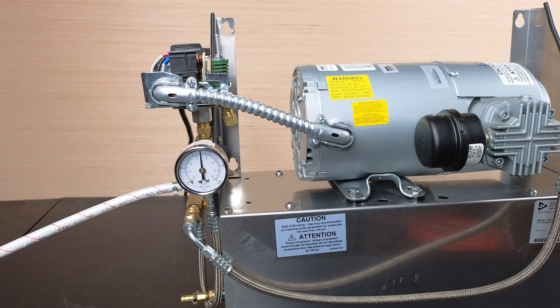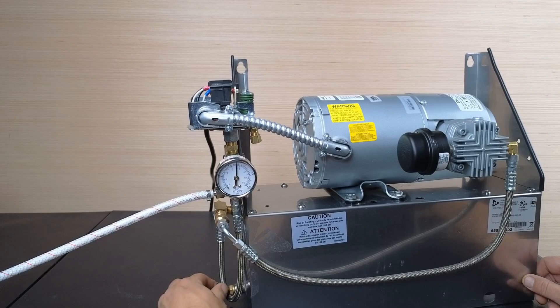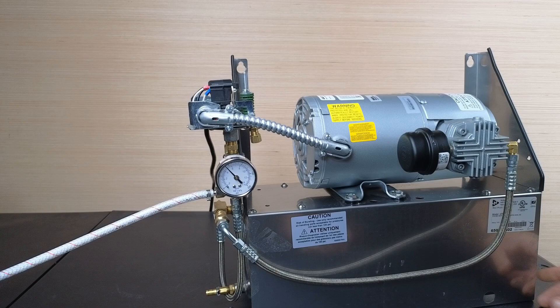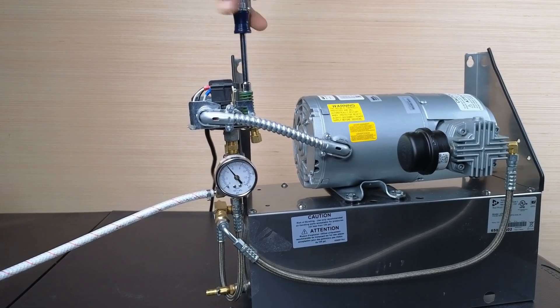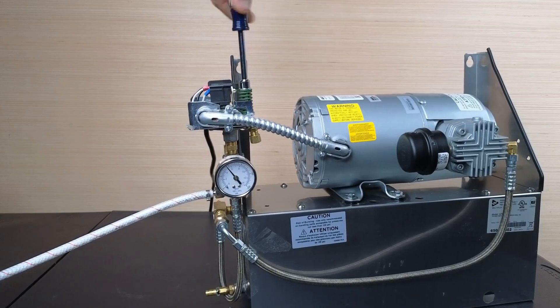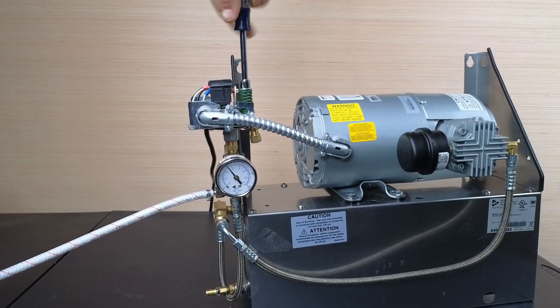You may have a situation where the switch is already closed and you need to perform an additional step. Step one: unplug the compressor from the wall outlet. Step two: slowly open the drain valve and release air from the tank. Close the drain when the gauge reads 75 psi. Step three: look at the contactors — are they in the open or closed position? In this example, the contactors are closed. Step four: if the contactors are closed, we need to reset the switch. Turn the large adjustment spring nut counterclockwise until it snaps open. Once open, turn the adjustment clockwise until it snaps closed. We want the contactor to snap closed at 75 psi.